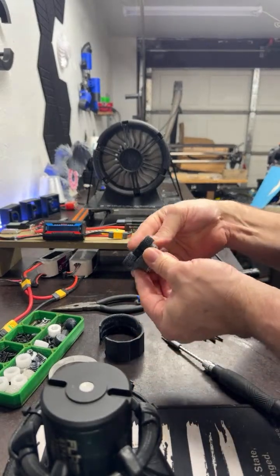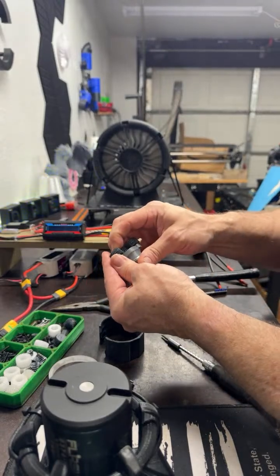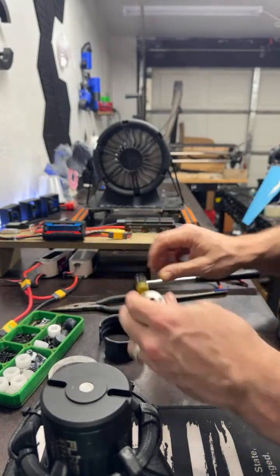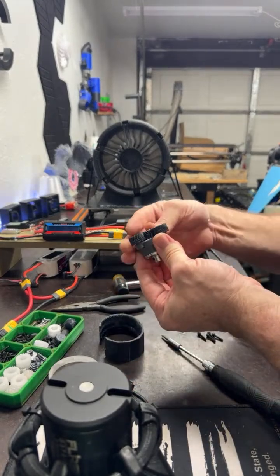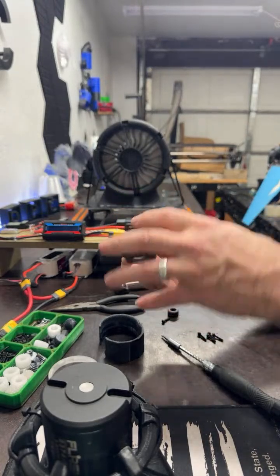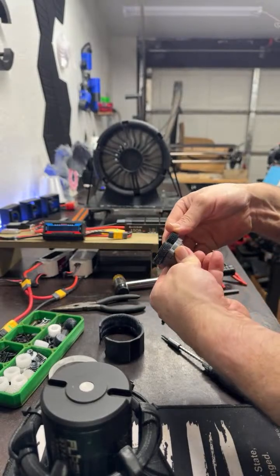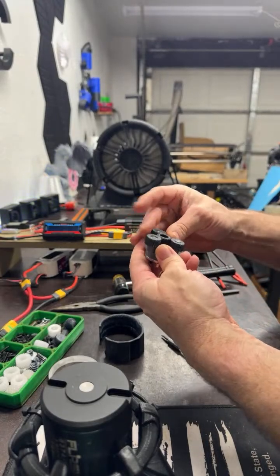See if she rotates. It's interesting because the TPU doesn't like the PLA sun gear in the center, but it is flexible, which gives me the ability to adjust things so that everything spins kind of freely. The metal gears won't be this way. It'll be much easier just to put everything together and then plop the bearing assemblies down onto the sun gear. There is some deflection in this one, just because it's TPU against a different material.